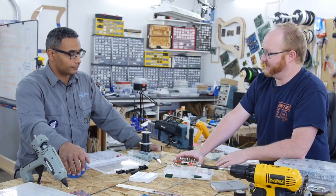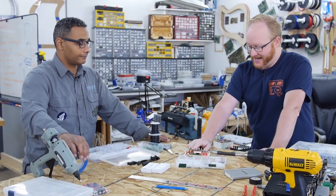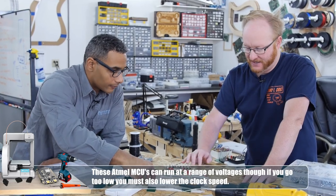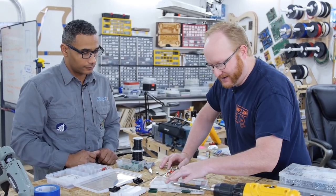What I was thinking we could do, Felix, just to test some of these ideas, is rig this thing up to work that way — pipe AAs into it and see if it still works. Let's mod this with an ATtiny25, hook it up to AAs, and see if it still works. If it does, I think we should start mapping this out and drawing it up in Eagle. I've already downloaded a lot of Eagle part diagrams off Element 14 for a lot of these things. Some I might have to make manually, but a lot of this stuff is bog standard — transistors and ATtiny are just a SOIC-8.